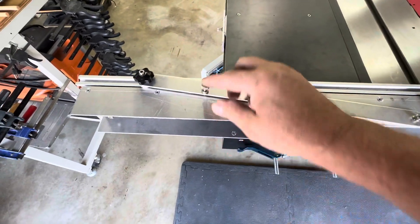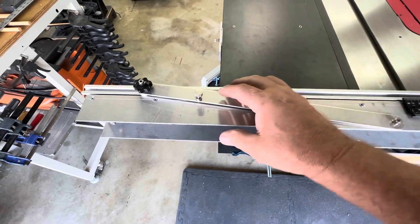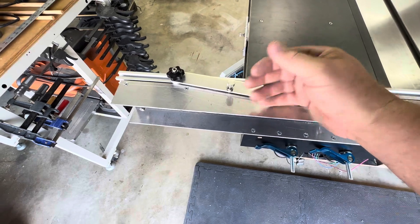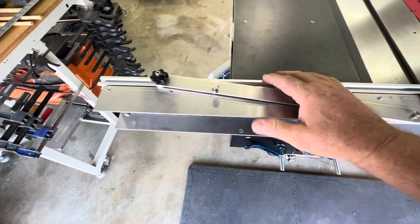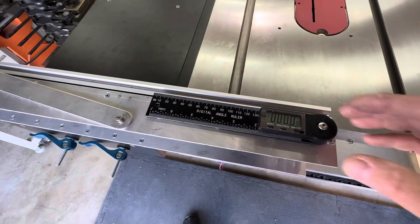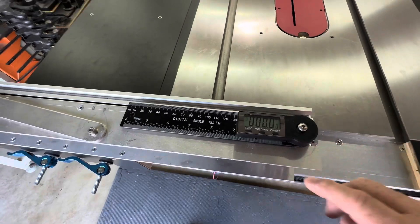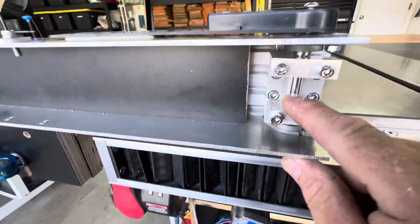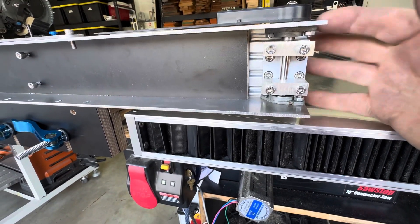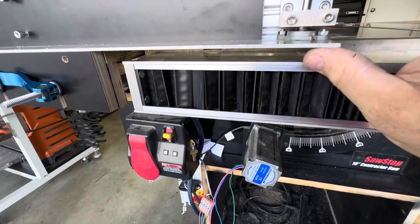This pin right here is a spring pin, and this helps hold it at zero degrees, because at this angle it's just too close to zero and it can still move just a little bit. I've modified an angle gauge so that the encoder inside the angle gauge is attached to a pin that is firmly attached to this front fence, and that rotates on a couple of bearings mounted to the top and bottom plate.